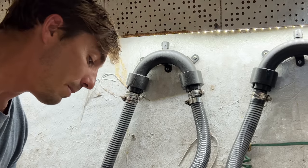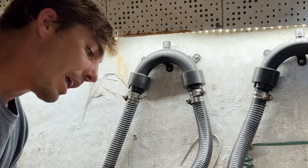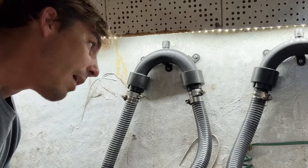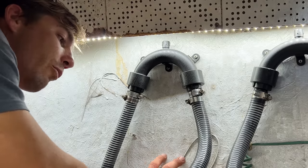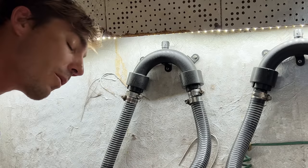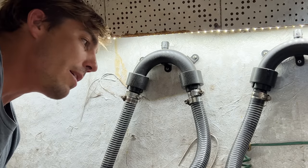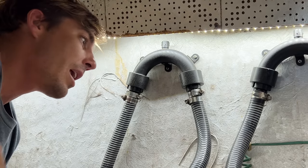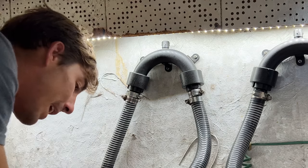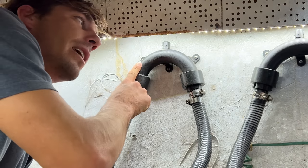It goes from the big bilges all the way up through this line, through the anti-siphon valve, then down and out the seacock right here. And we address the problem of any sort of wave pressurizing against this hole. Say we heel over a little bit or we get a wave against this hole. If water did pressurize this and come up through this line and down here and started flowing into the bilge, this is an anti-siphon loop.